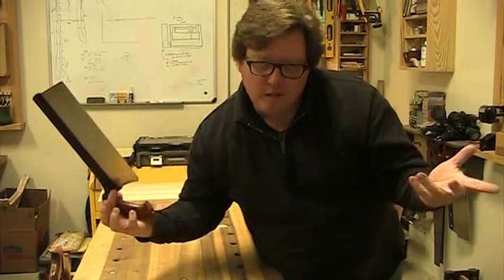I drop my fingernail into the knife line to reference it, look at my reflection to make sure it's passing through on both sides to form a straight line — that guarantees I'm plumb. I nibble a little bit, breathing out along the knife line to get rid of the dust. I'm not sawing all the way through. I come over the top — I was slightly off there, but we'll compensate. I do the same thing, nibbling and following that knife line, giving a path of least resistance. Now I have a cut recess on three sides that doesn't go into the middle.